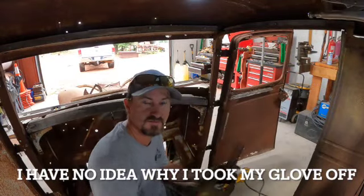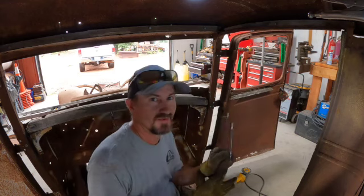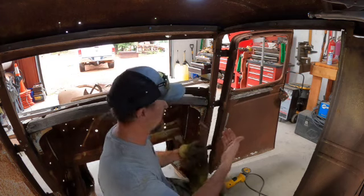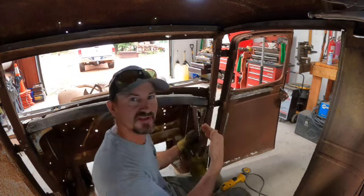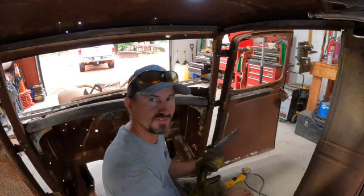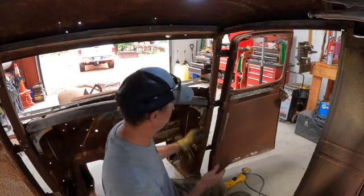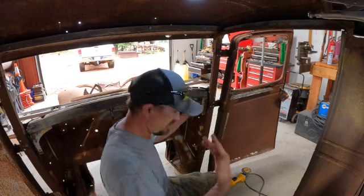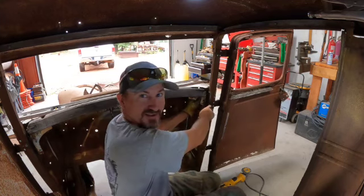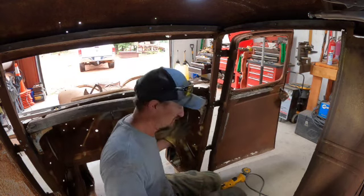All right, that side's cleaned up, and we're gonna make this side right. And matching this one. It actually looks like when they put that on the face of that, they pushed that side of the cab out almost 1/4 of an inch, because they had this welded on top of that, stacked onto that. That should be flush with this, and it's not. It was pushed out quite a bit, so we're going to fix that.